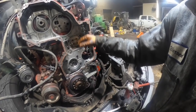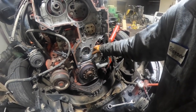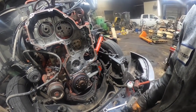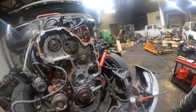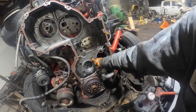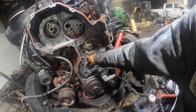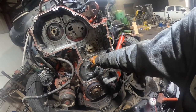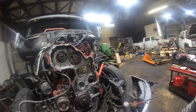Anyhow, get it all cleaned up, put your cover back on and torque these bolts here. There's bolts here on the outside too, and then the inside bolts, and then there's the special bolt, it says right there, special bolt. Let's see here. I'm trying to remember the torque. They were 41 foot-pounds, and then plus 30 degrees. And this one here is 41 foot-pounds without 30 degrees. Don't torque 30 degrees on that one. Just 41 foot-pounds. Put some blue Loctite on there so the sumbitch don't back out, get into that idler gear.